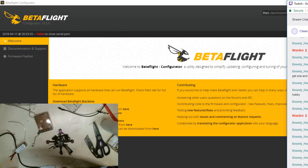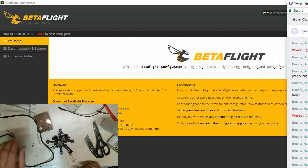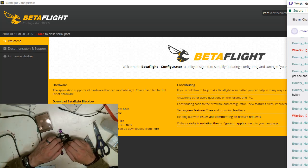Woo! That's hot. That got warm real quick. This is one of the ways that I clean my soldering iron off. You'll see it start to develop a bunch of black stuff on it. So I can just heat up a bunch of solder and tap it off, and all that black stuff will go off with the solder. So it's one way to clean them off. It's the way that I found...